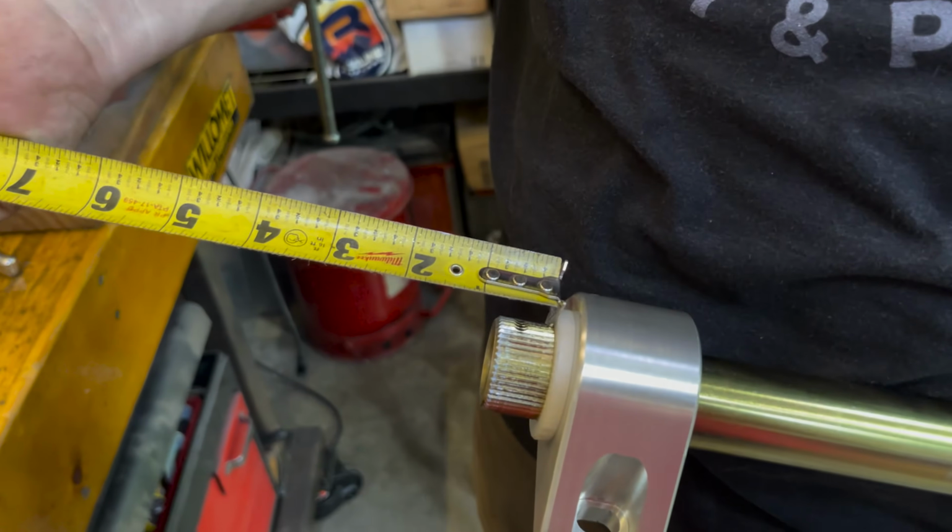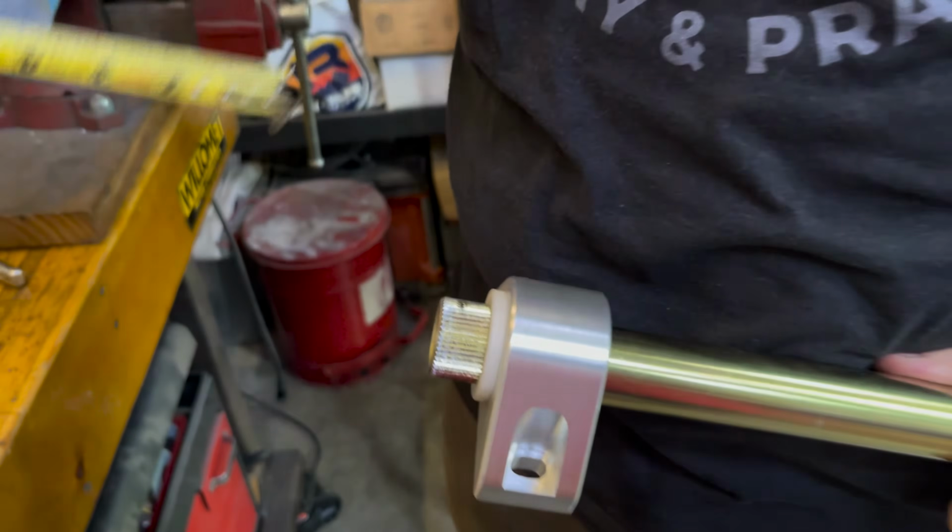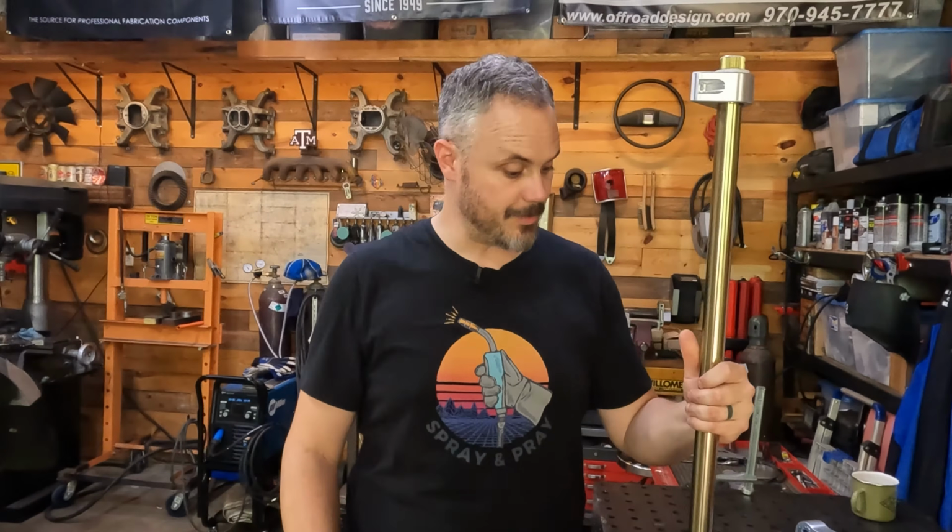So I got all the parts and pieces for the anti-roll bar and measured out what they were all going to be to try and figure out exactly how I needed to modify these frame rails. The short answer is it needs to be 33 inches on the outside and 30 inches on the inside. The pad mounts are 1.5 inches, but I could absolutely create that to that dimension, but I wanted to show that you can also just do this visually, just trust your eyes sometimes. And in this case, it's going to be as much about the picture as it is the math.